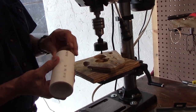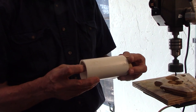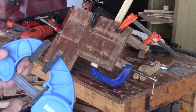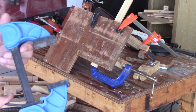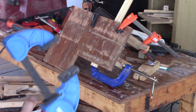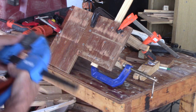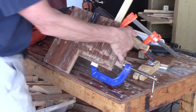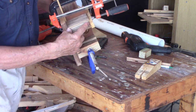It's almost there but I'll have to sand it down a little bit. I'll make two of these, one for each end, and then the threaded rod goes right through. You can almost just pound it in — friction fit. This is a Berman quick clamp. The quick clamps at Harbor Freight are guaranteed and they work. I bought a cheap black one at Lowe's and it didn't last a couple of weeks. What I'm doing here is drilling all the holes to hold the frame for the sander drum and the two-by-four blocks to hold the drill.